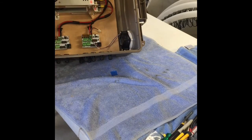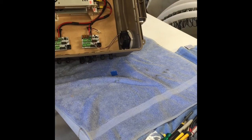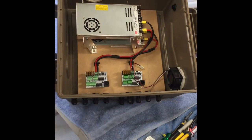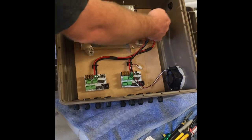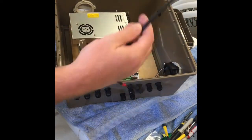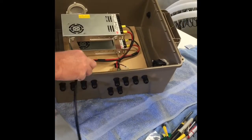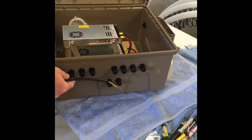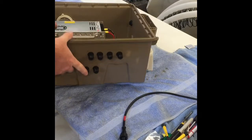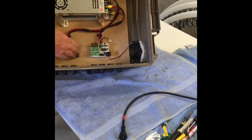As you can see, it's going to be drawing air in and exhausting it through the fan. Obviously we're going to have our 240 volts coming in there, and our pigtails going through the cable glands into each one of the outputs. The lower two are going to be for our data going to each one of the four strings.